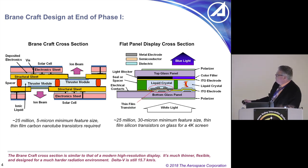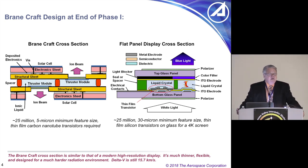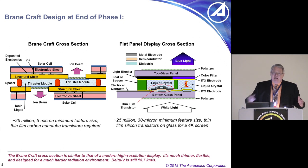The reason I went to smaller electronic sheets is that flat panel displays are made in China now. A foundry for making televisions or computer displays typically costs about five to six billion dollars, because you go in with sheets of glass about three meters square, process them, and then cut out individual displays afterward. If you start with smaller elements, you can make that foundry a lot cheaper.